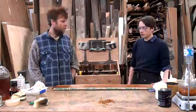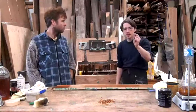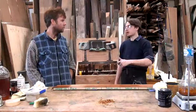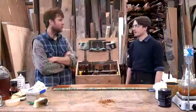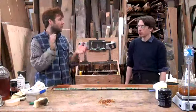If you've got something that's got a really thick plasticky coating on it that's probably gone a little yellow or creamy, that's really brittle, that's a sprayed lacquer. And to get that off, you have to remove it all, right? Scrape it all back. You can rework it a little bit, but it's going to be a lot easier to try and scrape that all off.